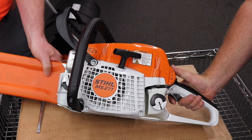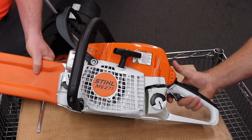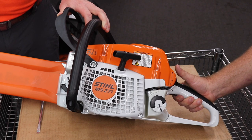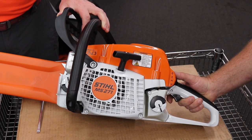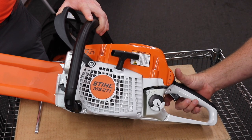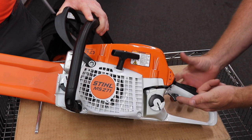Now we're going to talk about the master interlock switch, which is featured on almost all Stihl chainsaws and is featured on the 271. The operator will take one hand and place his palm to push the safety bow down and then squeeze the trigger — and after squeezing the trigger, then and only then do we engage the master interlock switch. Because if we try to force it down without squeezing the trigger first, we can and possibly do damage to the unit. So: palm down, push the safety bow, squeeze the trigger, then engage the master interlock. On a cold start, push it all the way down to the cold start position and then release the trigger.